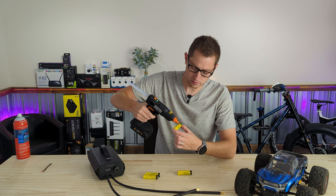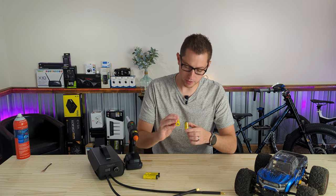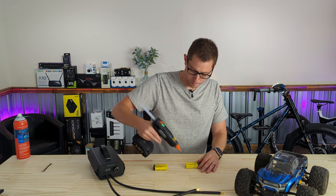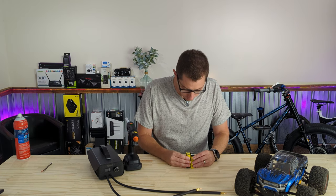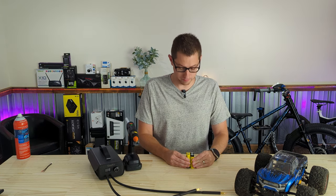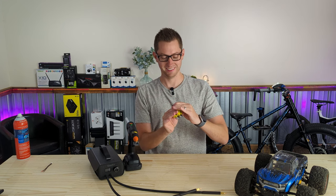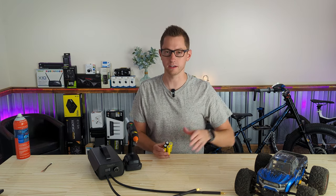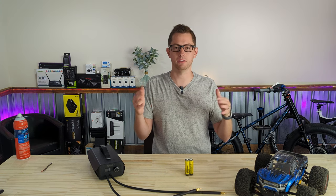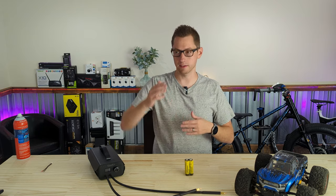It's not pretty, but four batteries are now glued together — a little off-axis, but the truck's not going to care. Now I need to spot weld them together. When you connect batteries in parallel, you are expanding the capacity of the battery. When you connect them in series, the capacity stays the same but you're expanding the voltage — doubling it if you had two, and so on.